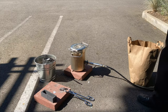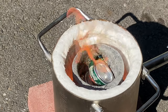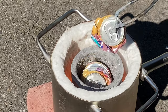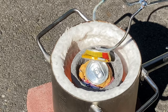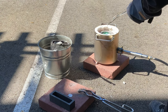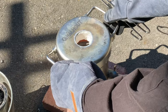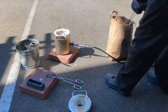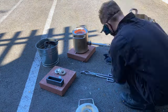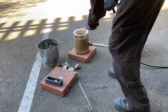This is more high-speed summary so you can see how I do it. A lot of soot and flame is released if you do it like that — put the lid on, it cleans it up. I did a whole grocery bag of smashed PopCans. When I push them in there it flares up with some yellow. So you can see here I'm pre-toasting the cans, and the crucible gets really dirty so I scrape it out. If I pre-toast the cans it fouls the crucible less.